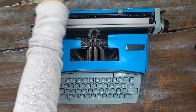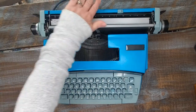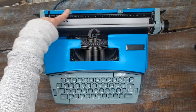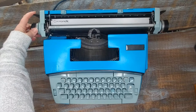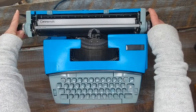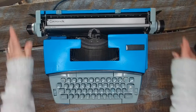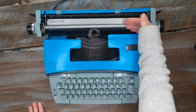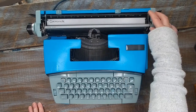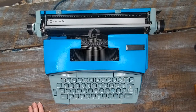First of all, you've got a paper holder in the back. You can set your margins by pressing and sliding. Here's your paper guide. Your carriage release is on either side. You can hear the bell. This is going to be the paper release — there's a bar down here that holds the paper really tight against the roller. You release this if you need to straighten it out or pull the paper out.